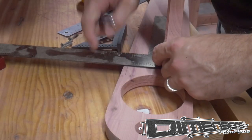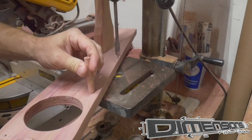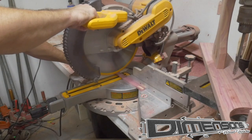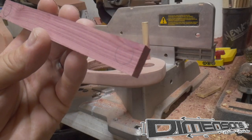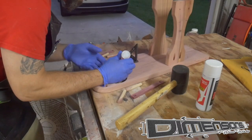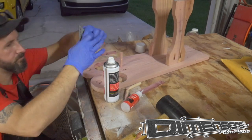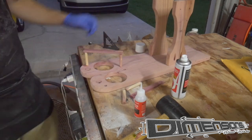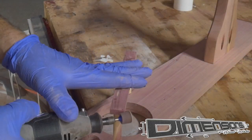I remove the armrest assembly from the swing and begin to lay out where I'm going to place the bottom of my cup holder. I want something there at the bottom to support the bottom of a can or cup when it's placed in the cup holder, but I also wanted it to be pretty small and not obtrusive. So to attach the parts for the bottom of the cup holder, I just used a little bit of CA glue and some accelerator because these pieces won't be getting beat up, and it just allowed it to bond quickly and to keep moving in the project.